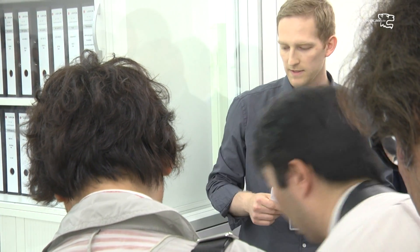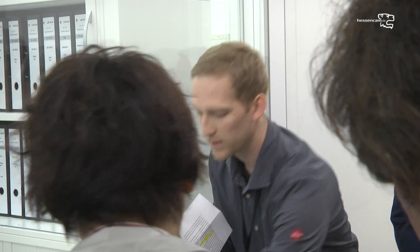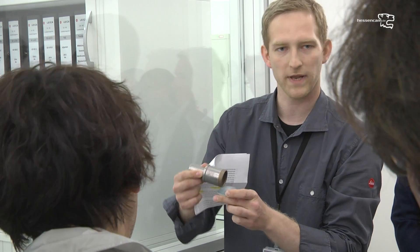The aspherical side of the lens also gets ground with a diamond tool, like the spherical side before, but not with a whole tool — only with a small point of the tool. You go over the whole lens with only that small point of the tool.